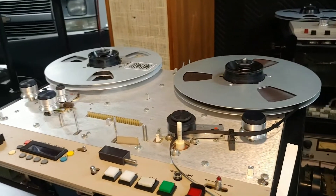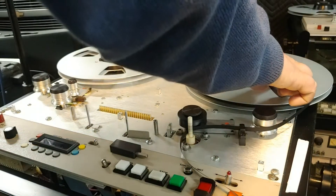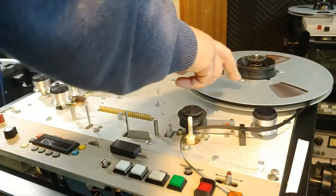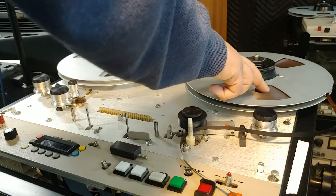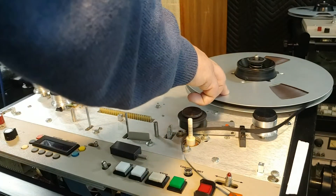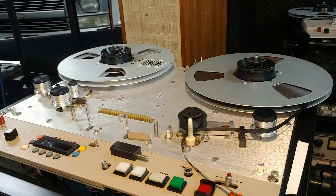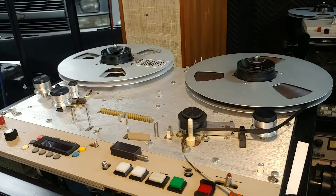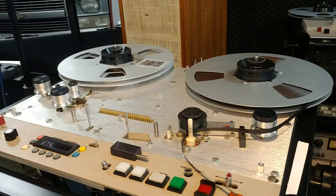The transport's running pretty smooth. One quick tip: if you look at a transport and you see the tape wound smooth and packed like that — looks like you could skate on it — the transport's probably running pretty good. That's one of the first things I look at.